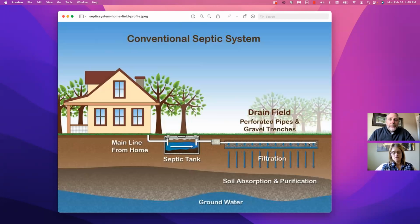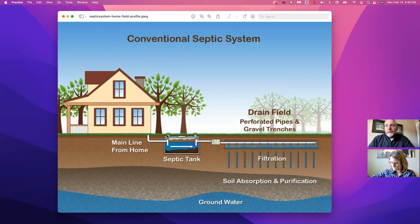Okay. So when you do an inspection, believe it or not, they're going to actually get into the tank and clean out the sludge and see how deep it is. They're literally going to put a rod down there that measures the depth of the sludge. Let's just say this is a 5-foot tank. They know that if there's less than 5 feet of sludge, it hasn't reached the drain line and they're good to go. Then they'll pump this out, get a little camera, look down in there, and make sure everything looks good with the tank, with no tree roots growing in it and stuff like that. So they do that during the inspection? The septic inspection, yeah. Believe it or not, a septic inspection does require the tank to be pumped, so a benefit to the seller is that they get their tank pumped.